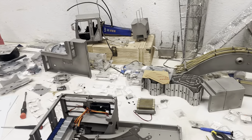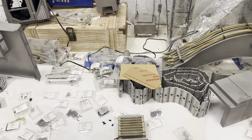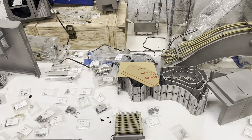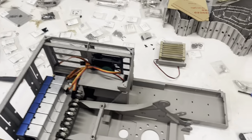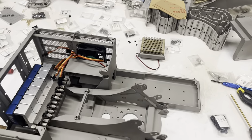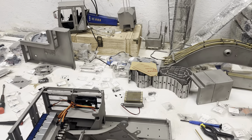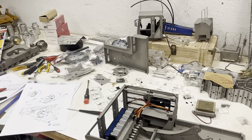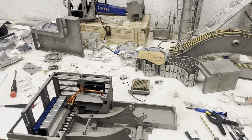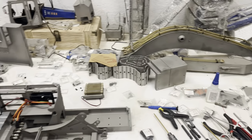And what you really need is the hydraulic tank, it's right here. I haven't measured it out, but it looks like it's probably 150-200 milliliters, so it should be big enough that the oil shouldn't run too warm. I think it bolts right up front here. Yeah, it bolts up in this front corner. We'll see how it goes. Maybe I'll have to make a new tank out of brass, something that's closer to 300, 400 milliliters like my Belarus. I worked the shit out of them for up to an hour, digging hard, and the oil's never more than warm to the touch. So the biggest problem with heat is having enough volume.